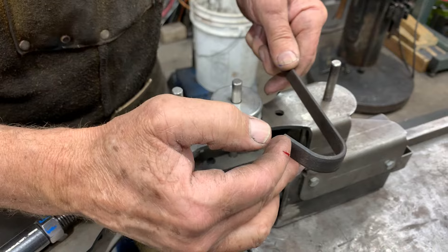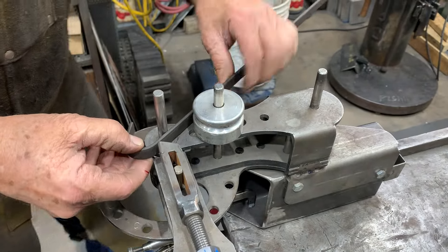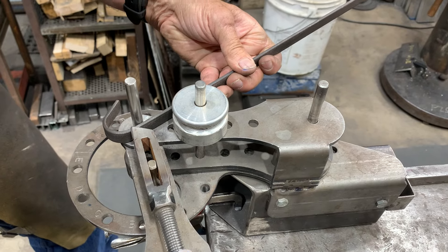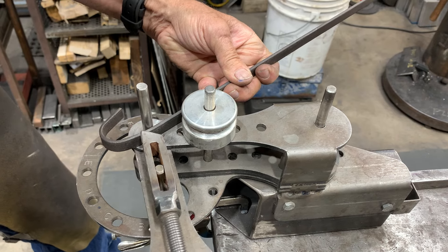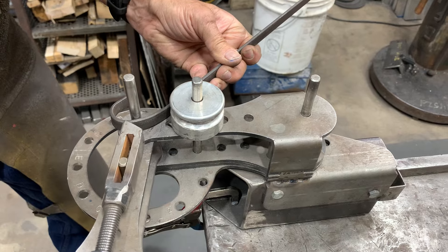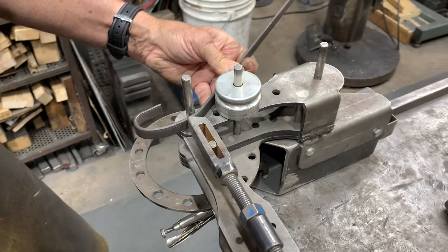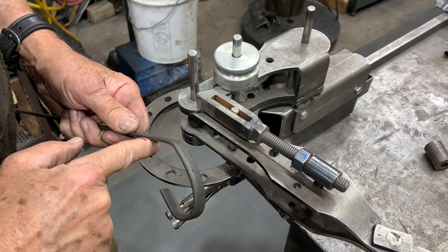That should be enough for a nice little hook. Notice I have a straight area here — I'll trim that off. Now I'm going to take out this pin and slightly bend. Notice how, using the adjustment, I can get really close to the central bending pin and just do a series of very small bends. These are the bends that are going to conform to the welding torch. At the very end I'll make one additional bend so that the hose clamp won't slip off quite as easily.